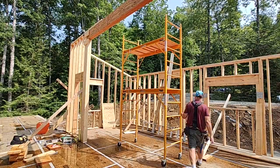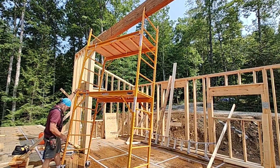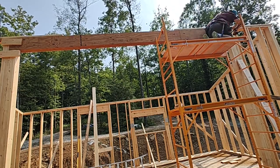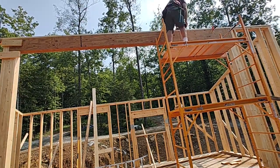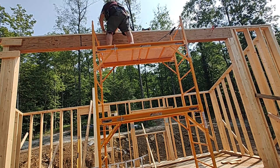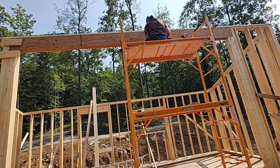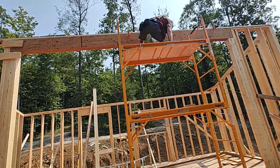It appears I built this house four inches too short to allow my scaffolding to make it through the passageway, so rather than take the whole thing down I maneuver it to get it under that crossbeam. To secure the LVLs I'm doing a couple of things: first, I'm putting a top plate over the LVL. This top plate runs even with the double top plate of the two load-bearing walls on either side. It allows a consistent surface for the roof rafters, and by overlapping the double top plate across the load-bearing wall and the LVL, it ensures a straight line all the way across for a consistent rafter measurement from one wall to the next.